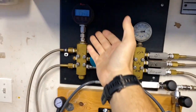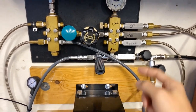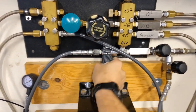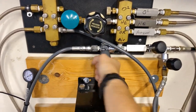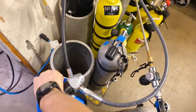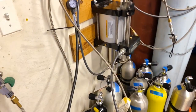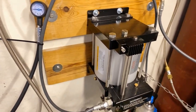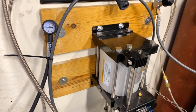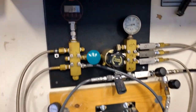This low O2 bottle is sitting right at about 750-800 PSI, and my aluminum 40 is at 1300 PSI, so there is no way of increasing the fill without the booster. I'm now going to let gas go through the booster nice and slow, open the valve up, and actuate the booster by opening up a bottle of air. You can also use a compressor or stored gas to drive it. You can hear the booster actuating - pressure over here is sitting at about 50 PSI and you can see it going nice and slow with pressure increasing.